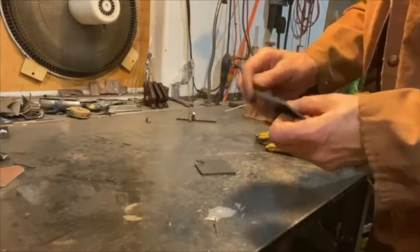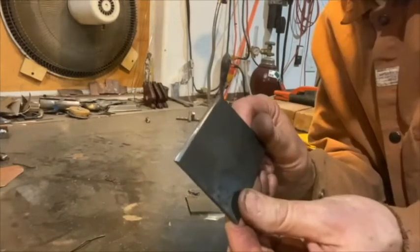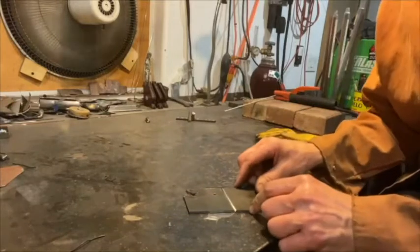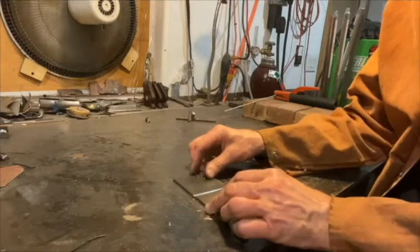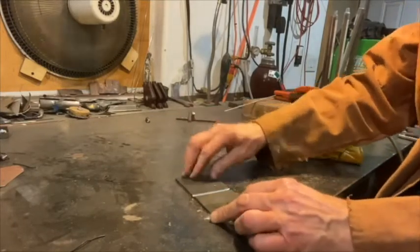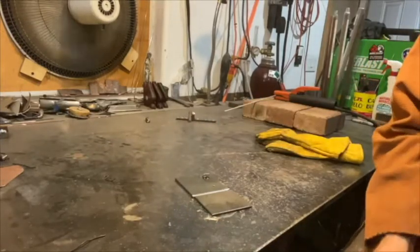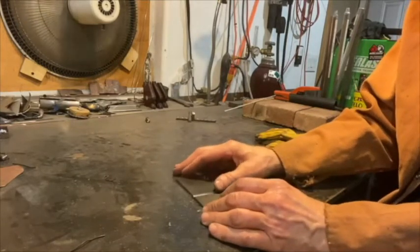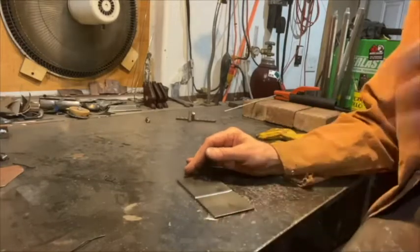Just to show you what I'm talking about, I'll grind a little bit on there. You can see how it's been ground on the edge — it's thinner on the edge. The reason I ground the edge is so I have a thinner area where I'm welding. Having a little valley between the two metals gives me deeper penetration. So you want enough heat to melt in, and for thicker stuff you want to grind a bevel so you're welding into that thinner edge and getting deeper penetration.